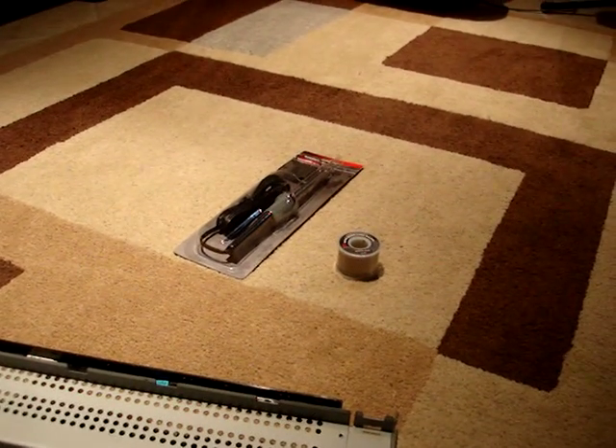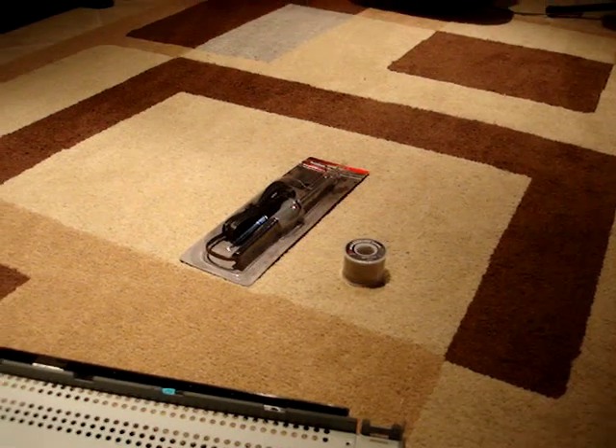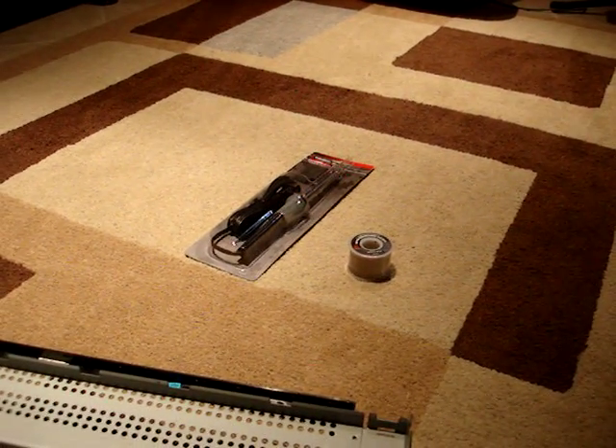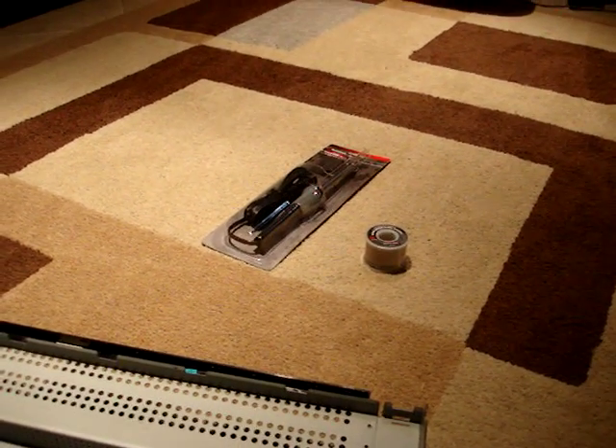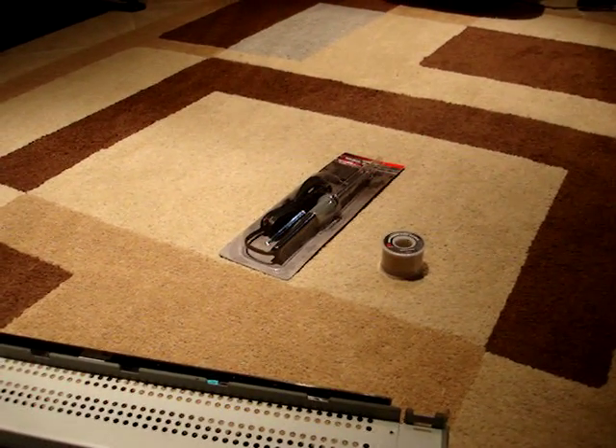What I'm going to do is remove this board from the panel, and using a soldering iron and a 3mm diameter rosin solder, we're going to remove the old caps and put the new fresh caps on. Then we'll power the monitor on and see if that fixes the problem.